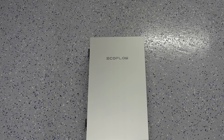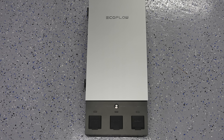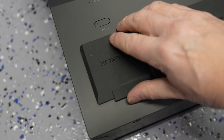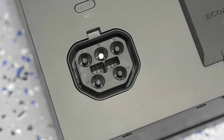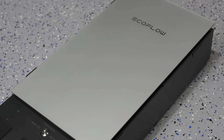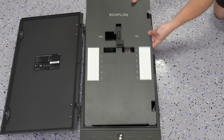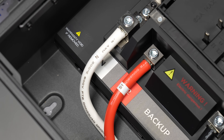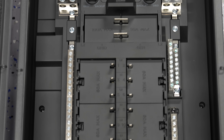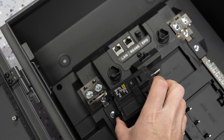For me, I like the interlock setup — it's easy, it's inexpensive, and it allows you to connect anything to that interlock outlet without much trouble. But if you want to go for the best, EcoFlow has introduced a brand-new Smart Home Panel version 2. They had this two years ago, but this one takes it to a higher level. It allows you to connect up to three stacks of the Delta Pro Ultras together, combining both the wattage and the battery capacity. One of these panels gets installed like a typical circuit breaker panel, except it's smart — each of the breakers in those slots can be individually controlled, handling power charging and discharge. You can even connect a gas generator to one of the breakers.